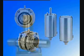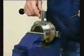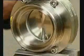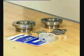The LKB butterfly valve controls product flow through a tube. LKB is either operated by means of compressed air using the LKLA or LKLAT actuator, or operated manually by means of a handle. When the valve is operated, the valve disc is either closed or opened. The LKB valve and LKLA actuator are characterized by easy maintenance, long service intervals, strong, reliable actuators, and optimum design with high-quality seals and valve disc.